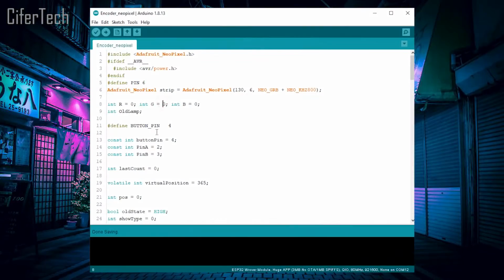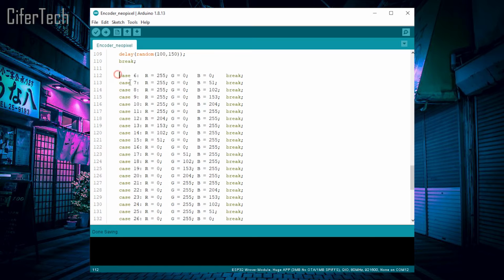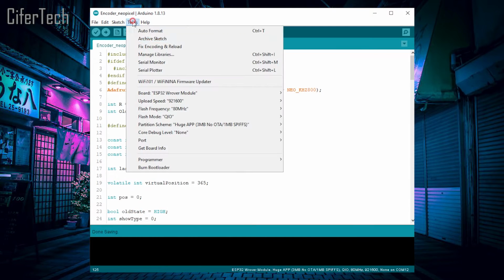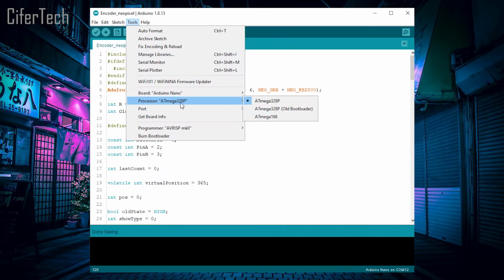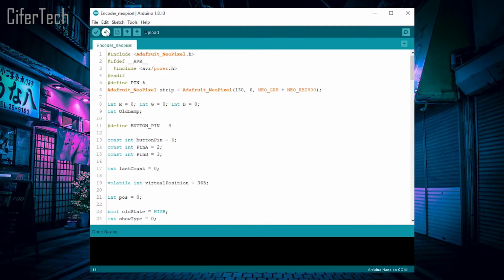For the code I set the needed pins for the rotary encoder and RGB string, then I simply add the RGB modes which I wanted. You can access the code by using the link in the description down below. Then in the last step I choose my board type, which in my case is Arduino Nano old bootloader, and it's ready to go.